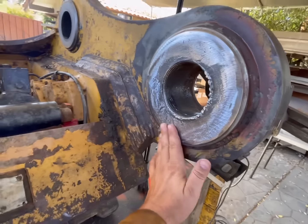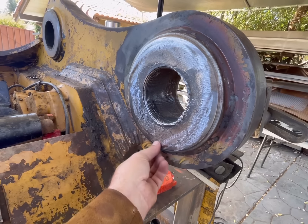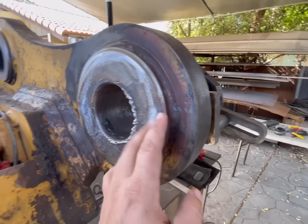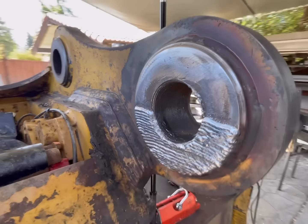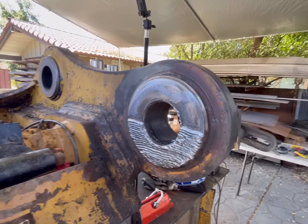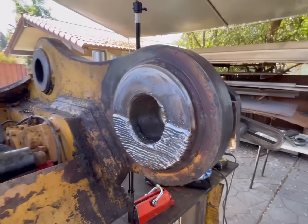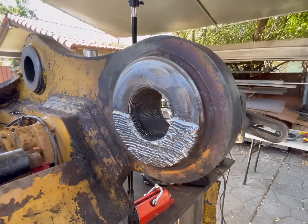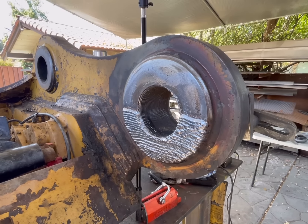We're gonna do this side. We're gonna try to slow it down a little bit and get a little bit heavier of a weld, a bulky weld on there. So hopefully I only have to do one layer of weld on this side, because this only needs about an eighth of an inch on this side. Got about half of this side welded up. Not quite sure if one pass is gonna make it. I did a quick measurement and we're pretty borderline, so might throw another pass on there just to cover all the low spots. So when I cut it, hopefully it will leave a nice perfect finish with no inclusions in it.